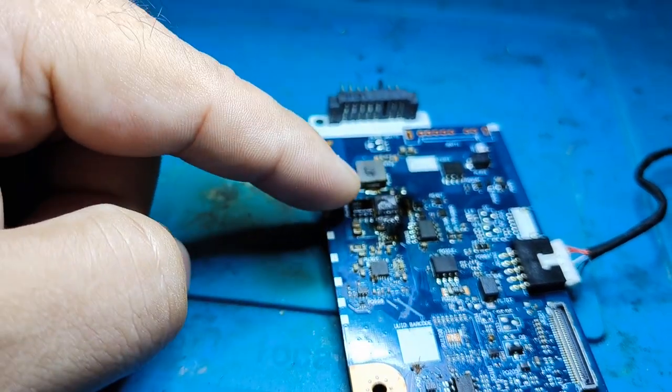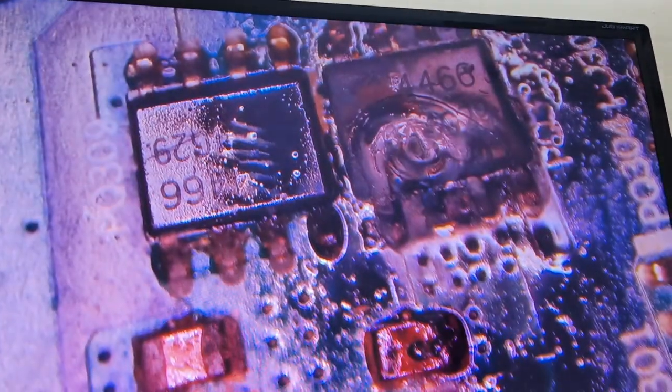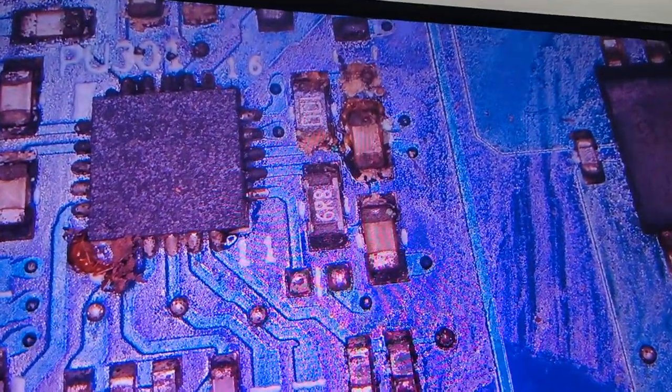The charging section is burning. This is a charging MOSFET — top and bottom gate — both MOSFETs are very badly burned. This is also our charging IC, which is also corroded. There are ants and something on it. These capacitors are also burned and corroded. We have to replace this charging IC.